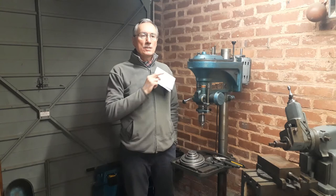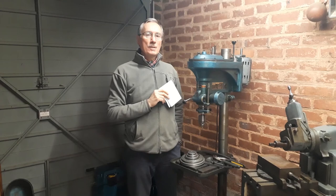Last night I thought more about the gearbox issue — the fact that it doesn't seem to be engaging properly in the high range. I had a look online and discovered this is a common issue with this kind of Meddings drill. Looking at the migwelding.co.uk forum, Brad93 has several posts based on his experience renovating a similar machine. It turns out there are two Tufnol gears in the back, and often those teeth get stripped. So I think before making the drive pulley, it would be wise to open this up and see the full scope of the work before me.